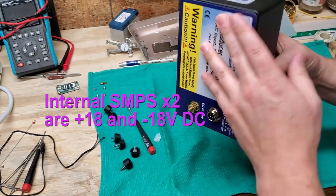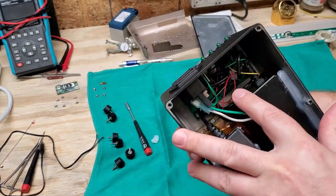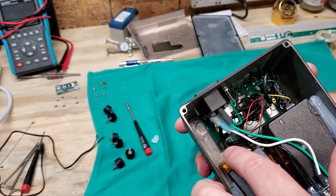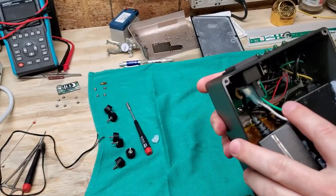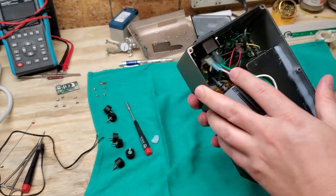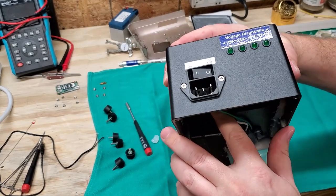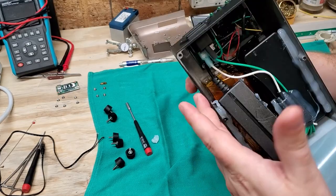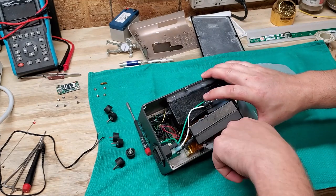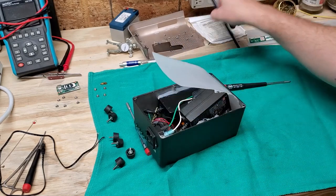Looks like two identical ones in the bottom. Way up in the top, they actually manufactured their own breakout board, so your DC lines come into this breakout board — that's where your port is and your DC common ground. Your other power lines go straight up to the regular IEC connector. Really quite simple. If anything goes bad, all you've got to do is get your heat gun out, heat up the silicone, pry them out, replace the power supply with another one, and put it back together. Very cool.